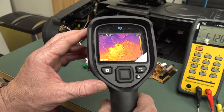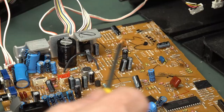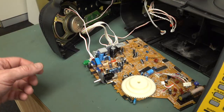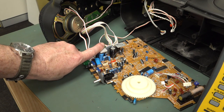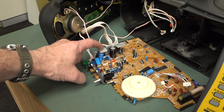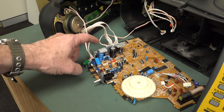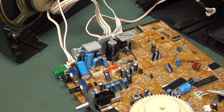I've just switched it back on again and it's not doing that — it's now drawing 40 milliamps. There it goes — 1.2 amps. Out of curiosity, let's see what's getting warm. There's one specific hotspot over there. That is the base of a cap. I just had to go up to an amp. Something behind — yeah, that's the power amp. That makes complete sense because the heatsink is getting warm and it's dissipating 10 watts. If you dissipate 10 watts in a cap, it's just going to explode. So maybe we've got some sort of oscillation on our power amplifier chip down there.